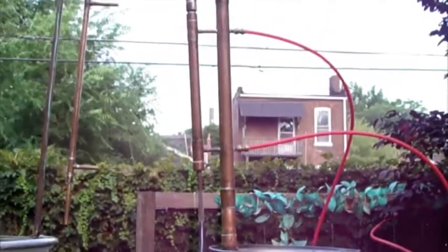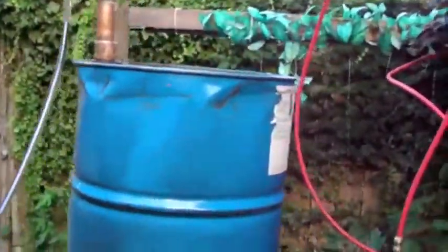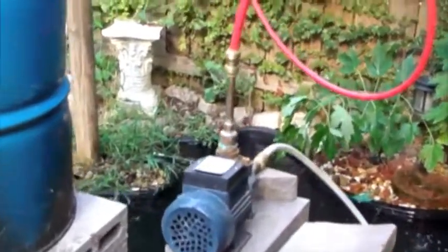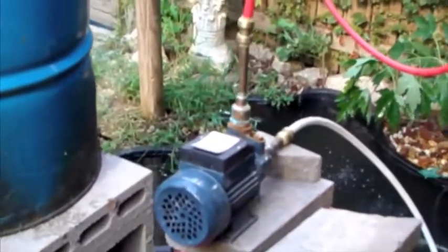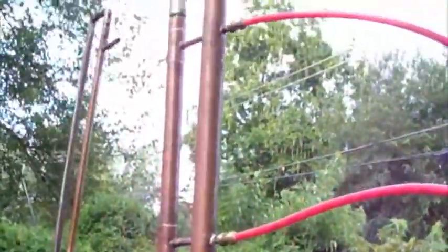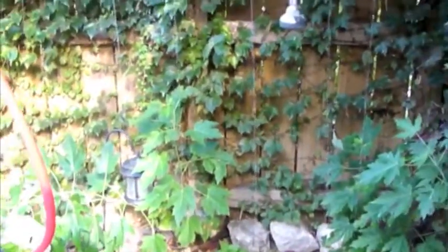2-inch copper column. It's packed with bronze wool. The cooling system is the roughly 10 gallons a minute centrifugal pump. We're pulling the water right now out of my decorative garden pond, piping it through the jacketed condenser, and then draining it down through the shower head back into the garden pond. I was going to have the pump running, but it's incredibly noisy.